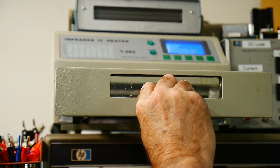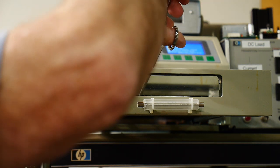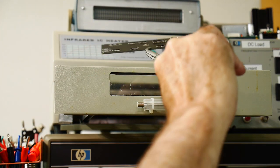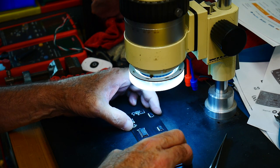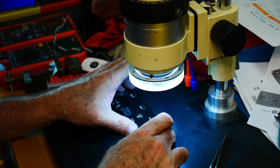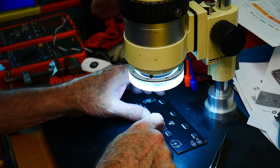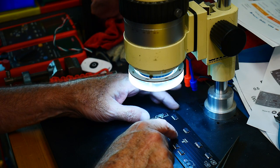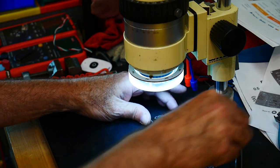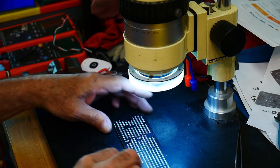Okay, let's take out the parts and see if they're baked. They're very, very hot — do not reach in with your fingers. Let's put them on the microscope and see if they're any good. I got one solder bridge on that one, solder bridge on that one. Mine was a little too much solder down. Not bad — could have been better. Not my best attempt. I think the thickness of this board didn't allow it to heat up as much as the thinner boards. Give that a touch-up, flip it over and do the other side.